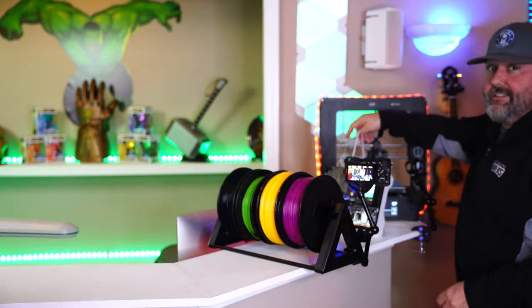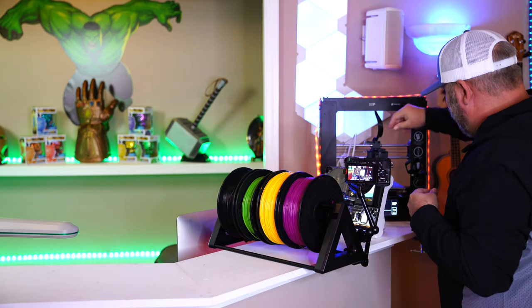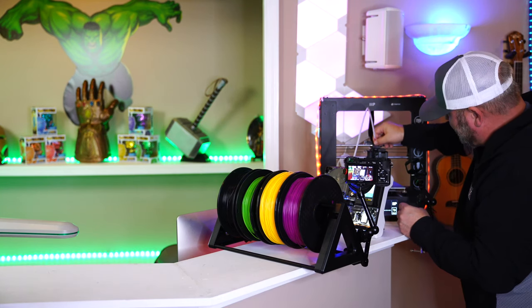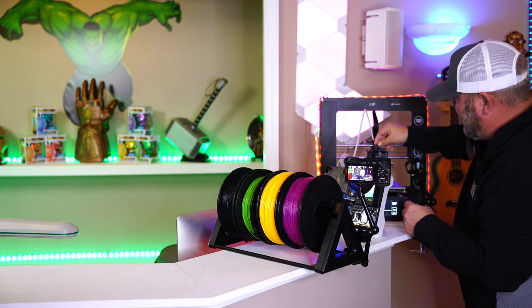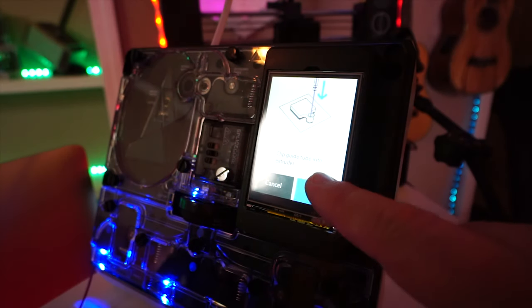All right, so you guys can see up here, the filament's come out the top. It's purple, and it's pushed out the filament as I've loaded filament into my Monoprice Maker Select Plus. So I'm just going to help this start pushing down, and it's going to start feeding my filament into my extruder. Okay, I'm going to hit next here,